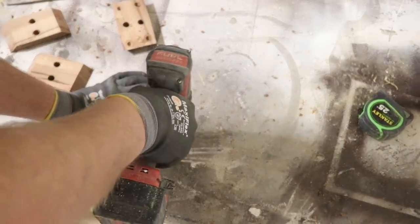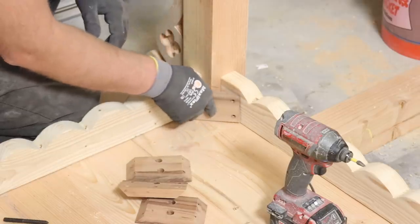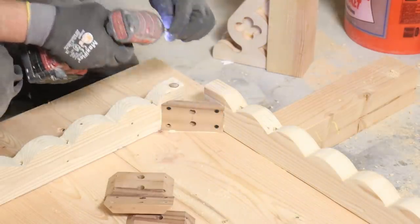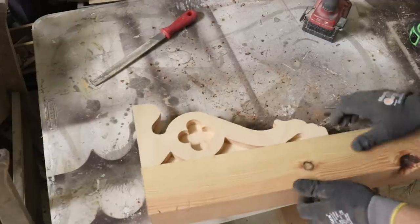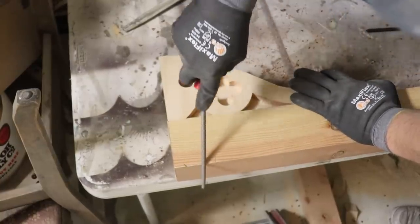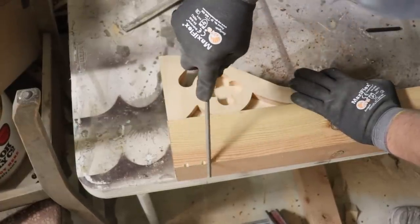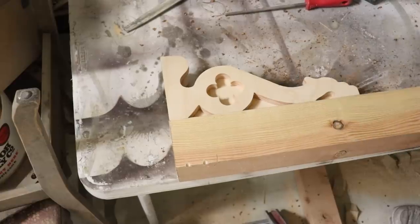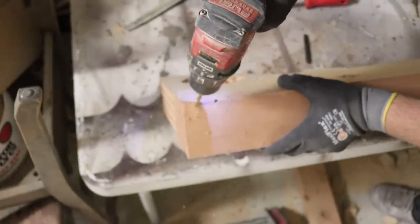The brackets are almost done — I just need to countersink some holes. I've got the brackets all made up and these are going to sit in here right like so. It's time to insert the hanger bolts into the 4x4. This is just a round file — I've got marked here where the bolts need to go and I'm just going to flatten this spot off right where I want the bolt. You could cut this out or even cut it square, but I find this works really well and helps my bolts get started easy. My hanger bolt is 5/16ths in diameter and I'm going to be using a 1/4-inch drill bit to start a pilot hole for these.